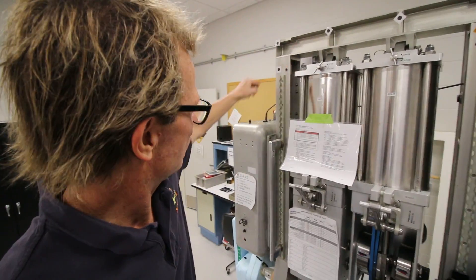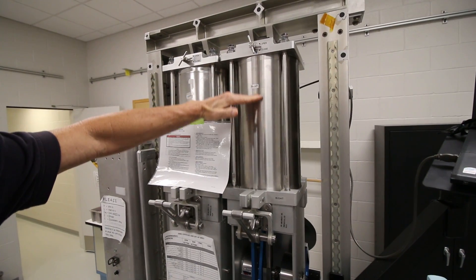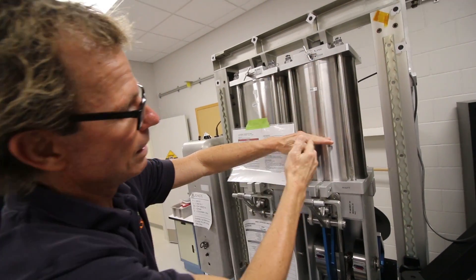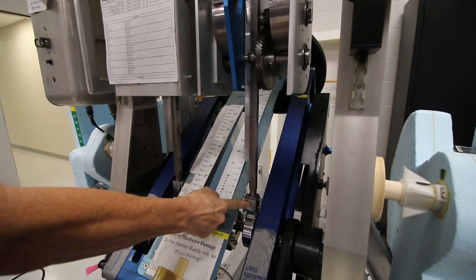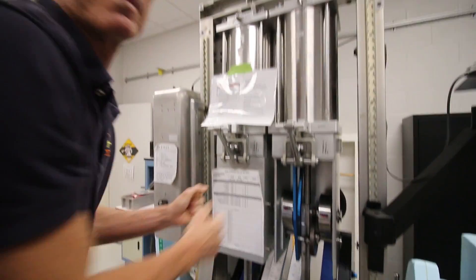So how do they do it? The heart of the system are these two canisters right here — they contain a vacuum. If we could look inside the canister, you'd see a piston that would slide. Wait — because a vacuum never changes. Yeah, the vacuum is always the same. So instead of pressurizing air and pushing against something, you're just going to pull it. The volume of your vacuum is right here between the piston and the top of the chamber. Attached to the piston is a rod, and the vacuum always wants to pull those rods up — exactly like a syringe. This is really clever.